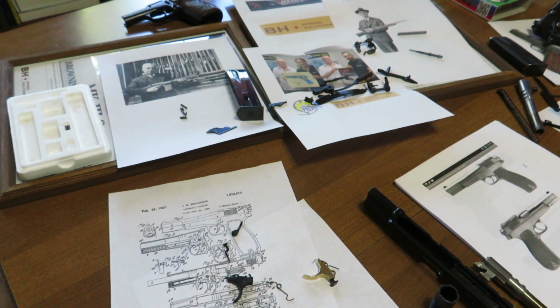This would not have existed in any normal operation of the 1927 Grand Rendement. Dieudonné Saive redesigned the sear lever, so it now floated and did contact the sear before one would have any intentions of firing. Also, what came out of it was a barrel with a design tendency to fracture, as we now know, as well as a firing pin retaining plate that has a tendency to fracture. Also derived from Dieudonné Saive's completion of the P35 were magazines that stick in the pistol, especially out of a stock unmodified high power, and the necessity of a lot of tools to take one of these apart. No longer could you do it the John Browning way with no tools in sight whatsoever and using the slide stop for your screwdriver.